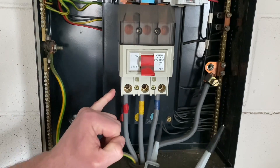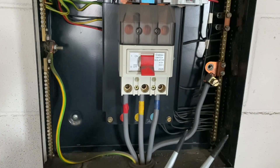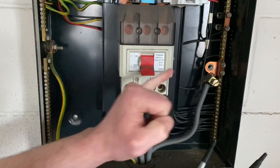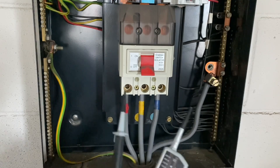I'm first going to check between the protective conductor and L1, L2, and L3. Then I'm going to test between the protective conductor and neutral. Then between neutral and L1, L2, and L3, and then between the line conductors — least dangerous conductor first, being our earthing conductor.